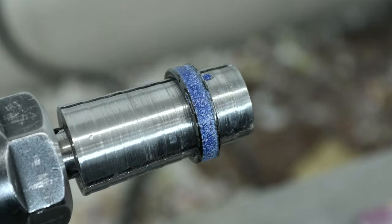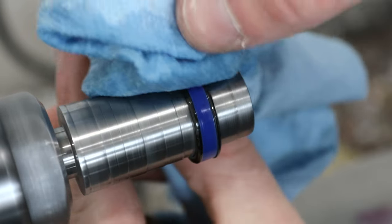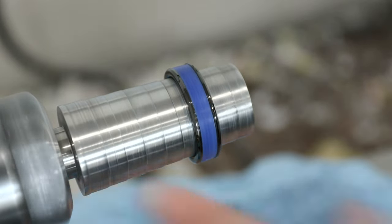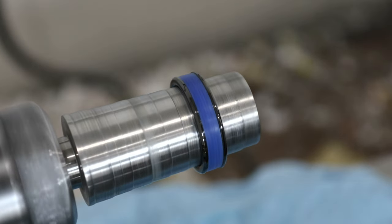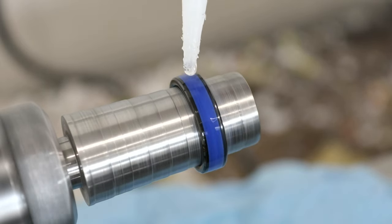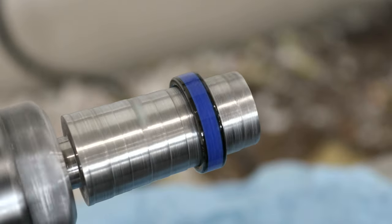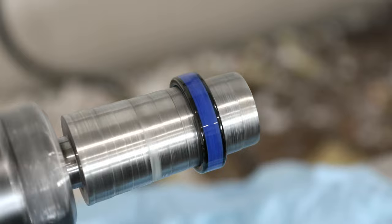And then I slow down to 150 RPM to 200 RPM, and then add a few drops of the Flex-CA. That Flex-CA is what we always use as the finish, just because it has a little bit of flexibility to it, so it doesn't crack under pressure as much as the regular CA. So we'll let that dry up. It gets really ugly, which is great. It's fine as long as we don't have any air bubbles.